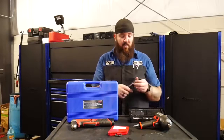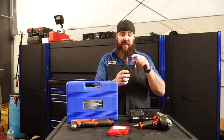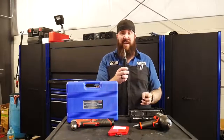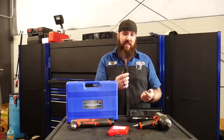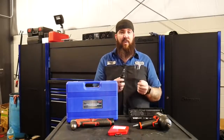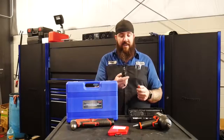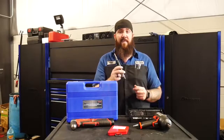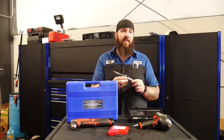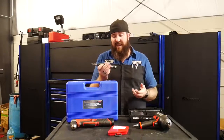It's just not that hot of a tool. A lot of what I really wanted to use this for was heat shrink — those tips with no tip end for soldering where it's just open and heat and flame come out. On this specific version, the tip is about an inch and a half long, which really takes down on the heat output. You're really not getting a whole lot of heat output on the end. I have to hold the heat shrink usually within a half an inch of the tip to shrink it down all the way. On top of that, this thing eats up butane — I'll go through the full tank in approximately 20 to 30 minutes of use, and of course you already have it turned all the way up because it's not getting that hot.